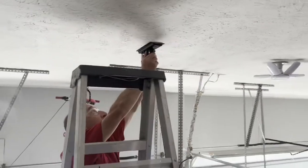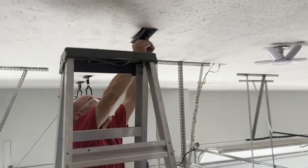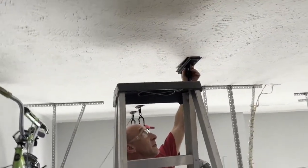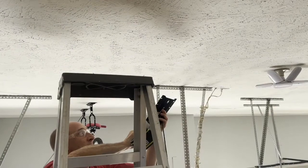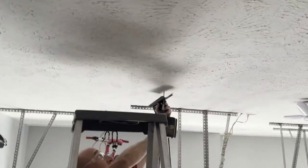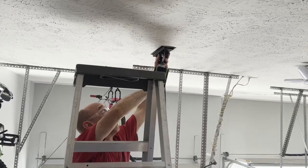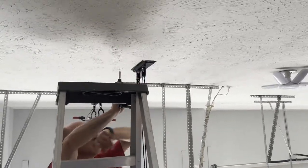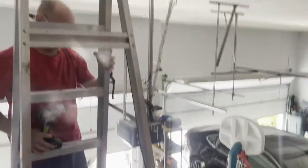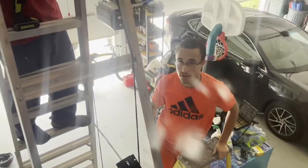I need a screwdriver. It's a bit of a challenge to hold it up there and get the screw in place. If you've got a magnetic screwdriver, you can just bring it up and meet your hole. Get one in to kind of keep it there — make sure it's tight and make sure you're into your stud. If it doesn't stay, you're probably not in the stud and you're going to have to recheck that with your stud finder just to make sure that once we put our bike in, the whole machine won't break off.